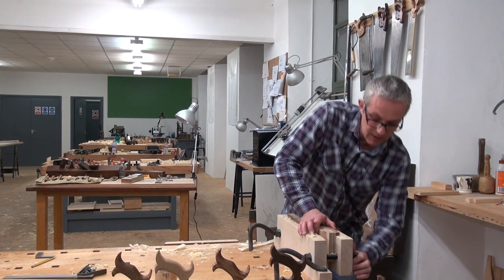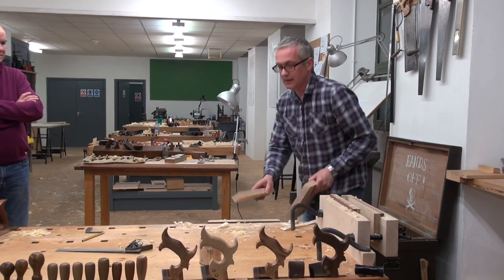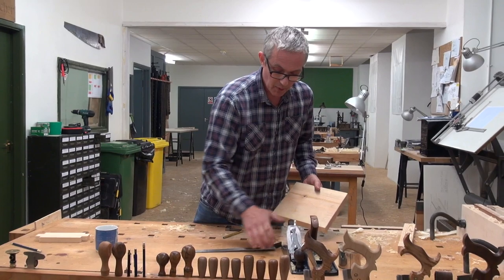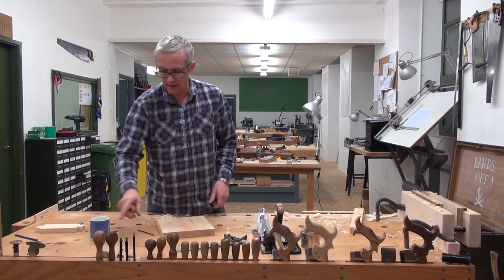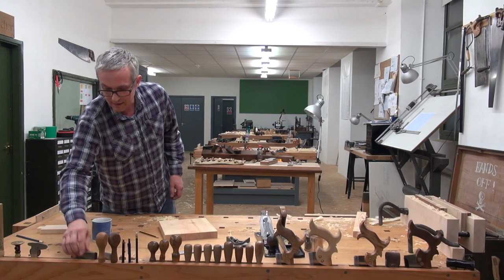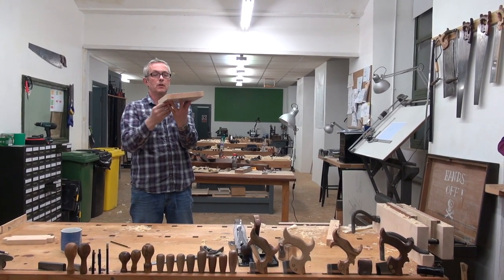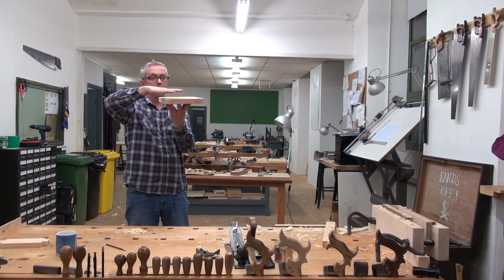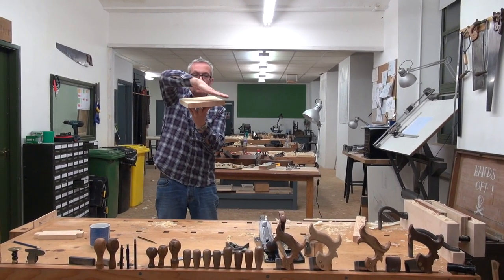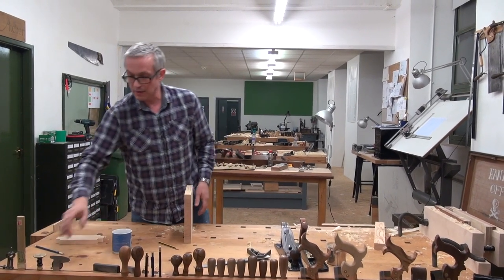So that's how we do the dimensioning in terms of length and width. Now, if you've started planing the other side of your board, we've got a flat and out-of-twist side here. We could make this flat and out of twist, and still have it a little bit out of parallel with the other side — it might be 25mm at one end and 28mm at the other. So what we're going to do is use a marking gauge to give ourselves a reference from our flat side.